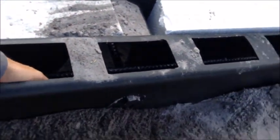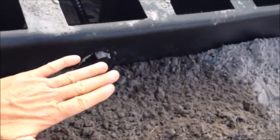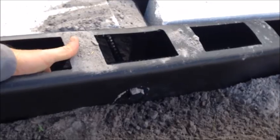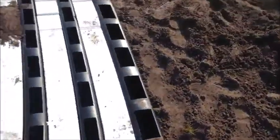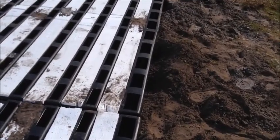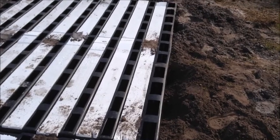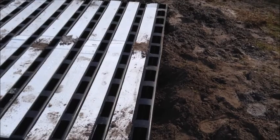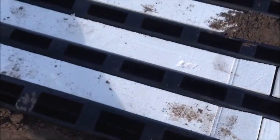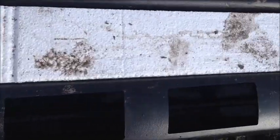Filling it in helps hold the shape because concrete is going to go in there and you don't want it to pull out. You don't want to tamp this real hard — just light. When the concrete pressure comes in it should come out just right. We took the dirt away from one area a little bit because it was pushed in too much. Once the concrete goes in it will push back out and we'll put the dirt back. When you tamp around the edges, you don't want to go bang bang bang real hard — just a light touch, very light, because you want to keep those walls as straight as possible.